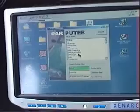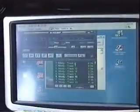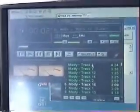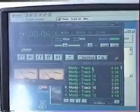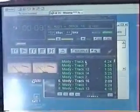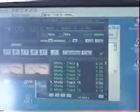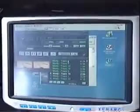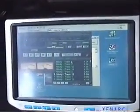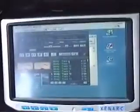Command Moby. And there we go, so we've got a confirmation beep and it starts playing Moby. Now a recent feature I've built into the voice command software is that as soon as it hears the keyword command it will mute the sound, which will increase the chances of a successful recognition on the next word, because obviously when the music's playing quite loud it makes it a lot more difficult for the software to detect what you say properly. So let's give that a quick go.